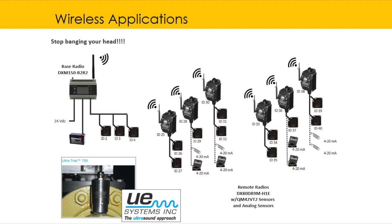When you're dealing with multi-hop radios, you have to make sure you set each node as its own slave ID. When binding your radios, make sure your gateway is one address and your node is another address — they're actually not going to match. If you need help learning how to do that, the datasheet that comes with the radios walks you through the procedures. It's very simple, so we won't waste your time with that right now.